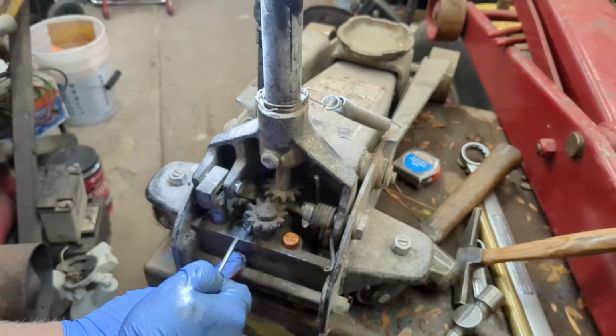This does nothing. This just sits probably 1/8 of an inch from the ball. It just lets the ball move up about 1/8 of an inch, 1/16 of an inch. Fluid goes past and goes right back down. Does nothing but that. So that surface down there is your seat. And I guess that could get pitted.